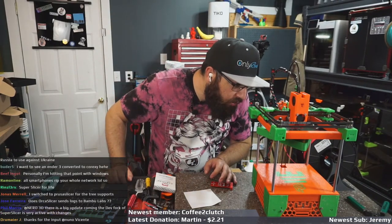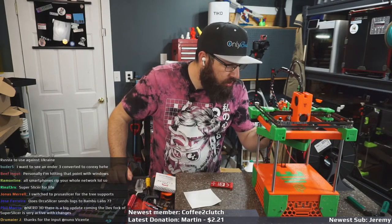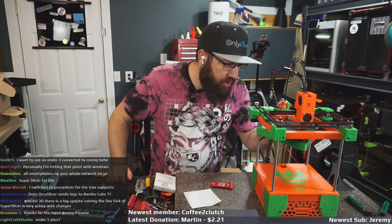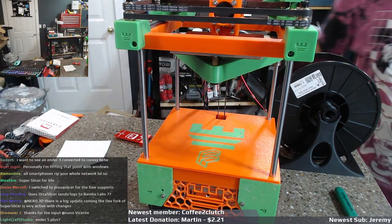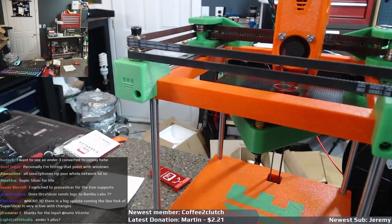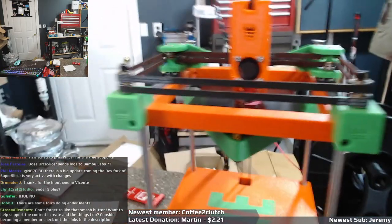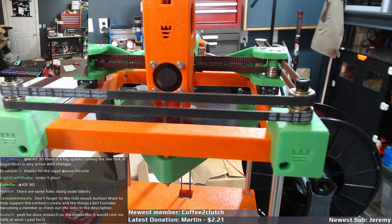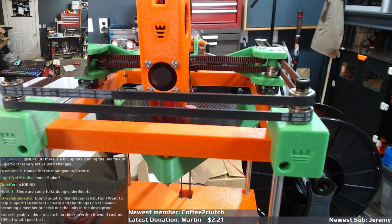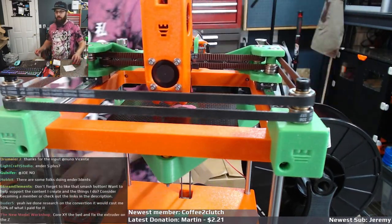Oh, okay, what are we doing? Are we too close to the bed? Is plastic coming out? Oh, it just oozed too much. Yeah, it just oozed too much. So that first layer is a little not great because it over extruded a bit. I don't know if I can get a camera angle in here. Damn you, Rook. Well, you could stare through the belts. Yeah, the first layer, the outer wall, it oozed too much, so there's no purge. I don't have a purge on this.